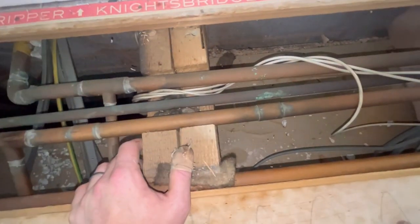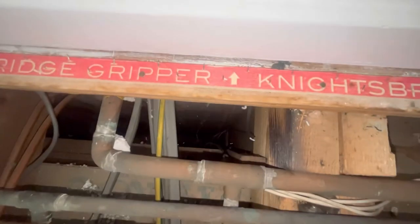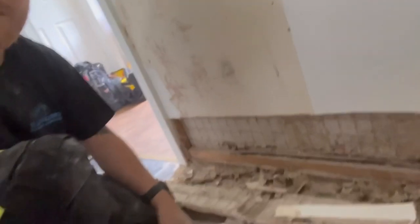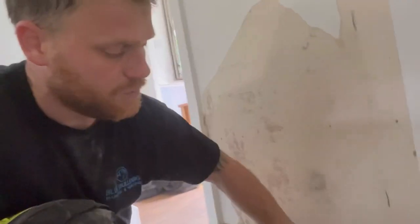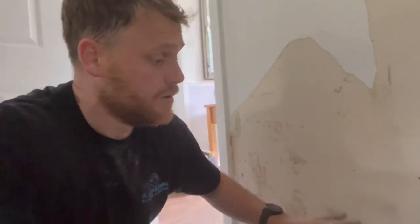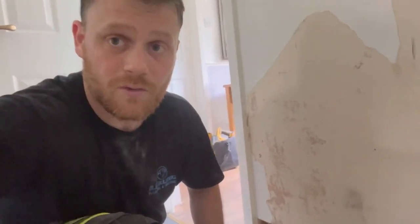I'm pretty sure they just doubled it up and plasterboarded it, so I don't know where we're going to be able to come up. Just started taking the wall out and it's that stuff — you know, stuff that's cardboard, like an egg box kind. The walls are really thin; the two walls get strength from each other. So the more of this egg-carton stuff you take out, the weaker the wall gets. You have to put supports in and screw it from both sides if you're going to re-plaster the wall. I'm going to have to rethink what I'm doing here.